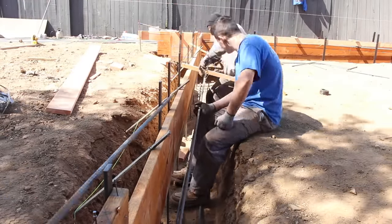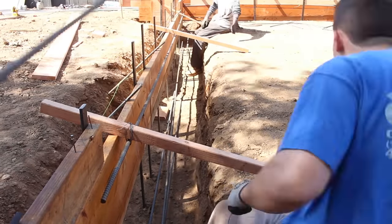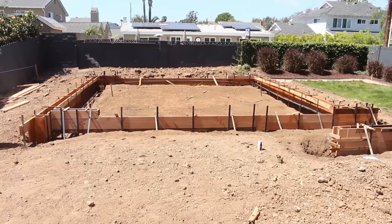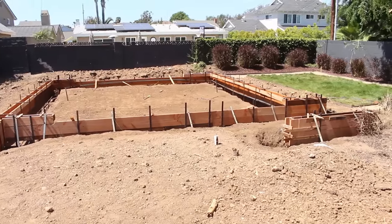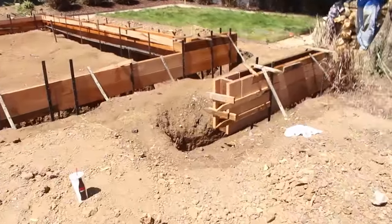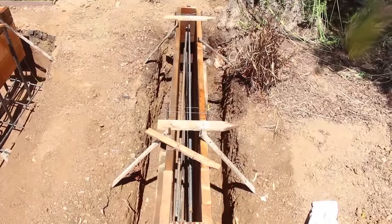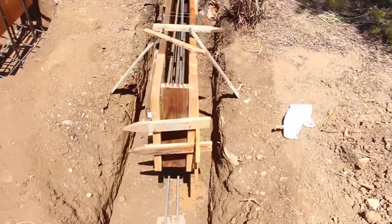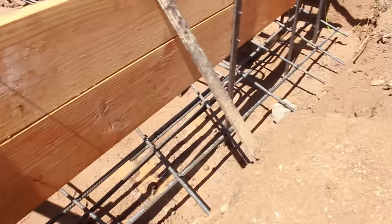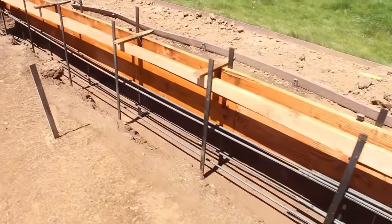All this grade in the middle — that dirt on the inside should be about eight to nine inches from the dirt to the top of form, since we've got a five-inch slab thickness and the plans call for three inches of gravel. This is just a single story garage. Here's what it looks like the day before inspection. We've got some dobies at the bottom because on these corners there's a little bit of extra steel where the corners get wider, so we had to throw some dobies in to support that extra load.